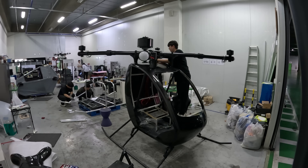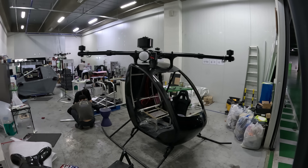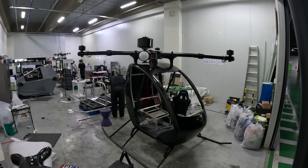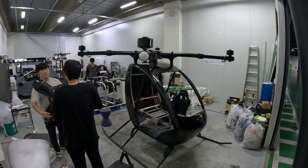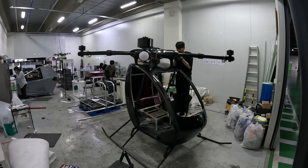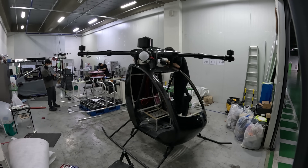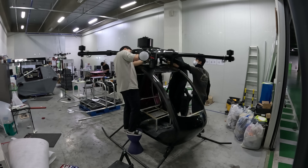With the control unit and GPS secured, I began the final wiring. Main power lines were connected with the thick XT-150 connectors; signal cables were routed through braided sleeving to avoid chafing. One last check on polarity and continuity — and then the moment I turned on the master switch, the lights blinked in sequence. The drone was alive.